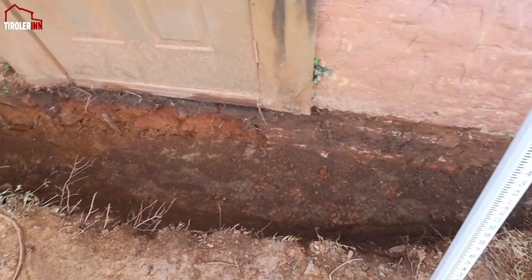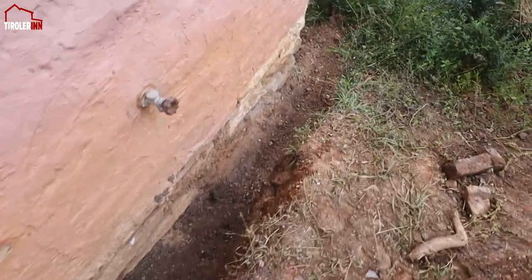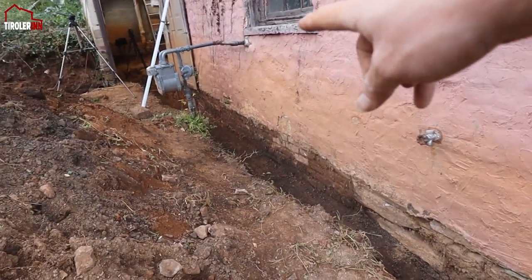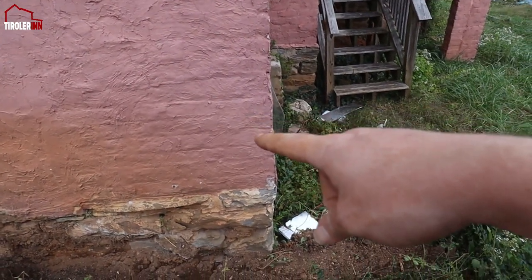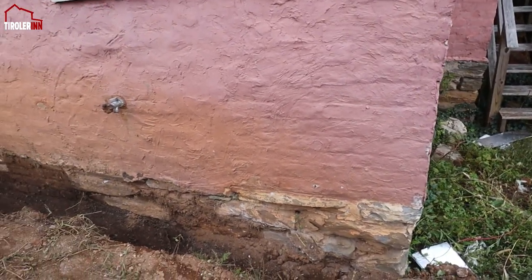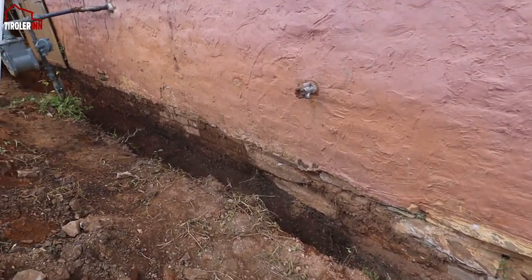This is much better now. We can install waterproofing membrane all along here in the foundation area, so that even here long term we won't have any issues. I will do it in a level section all the way from the door here, and then come out level to probably somewhere around here, just so that when we put a wall here and we make a driveway all nice and level here, we have the membrane already covering the entire foundation wall here.